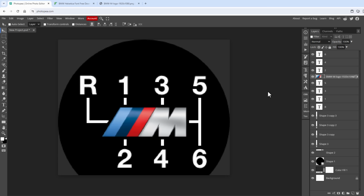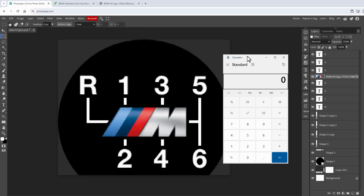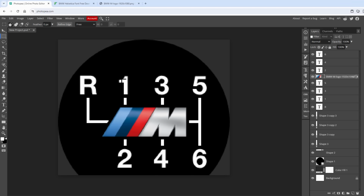I would like to of course see it before I start splitting this into smaller images. However, when I get the size of the image, 240 pixels times 198 pixels times 2 bytes per pixel, I would need about 95 kilobytes, but I only have 32 kilobytes on the Arduino UNO. But I think that I should be still able to display this image, and the idea is that I will just send the data from the PC to the Arduino UNO, and then the Arduino UNO will send the data to the display. And just because the display has enough memory to hold the entire image of the entire screen to have the frame buffer for the display, I think that something like this should work.